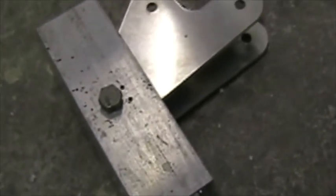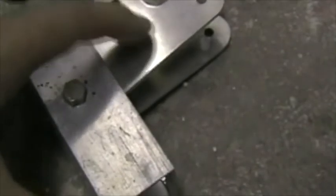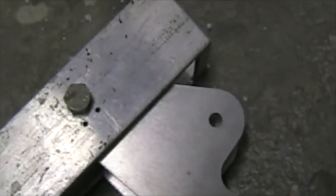Here I've prepared the aileron bell crank mechanism. There are the two laser cut 3mm aluminium plates. There's a spacer, I've used nylon this time. In there you can see the phosphor bronze bushes. And at the bottom is the anchor nut for the 1/4-inch bolt. Those two little holes are going to be used for lock wiring this bolt head ultimately.